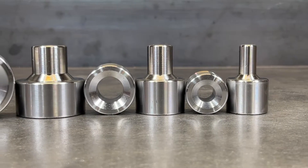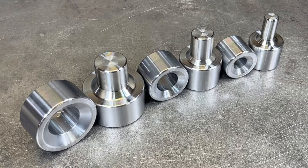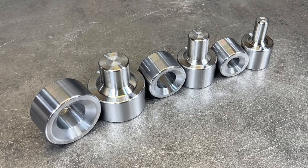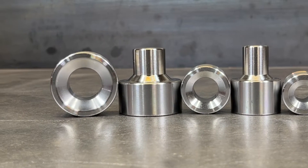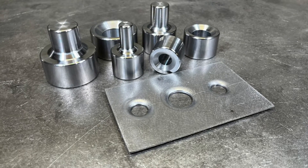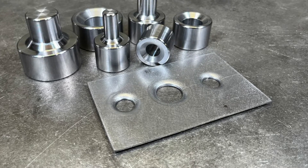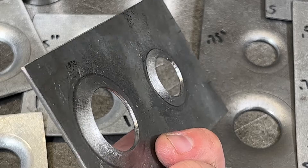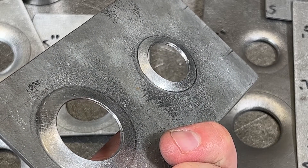Good dimple die sets aren't very cheap, but does that mean that cheap dimple die sets aren't very good? In this video I'm going to test out a set of dimple dies that cost me less than $50. A dimple die is commonly used in metal fabrication. To reduce the weight in a panel you can cut out or drill a hole, but in doing so you sacrifice rigidity. To get back and even increase the rigidity is where dimple dies come in. The flared edge around the hole can allow you to use a thinner gauge metal and stiffen up a floppy part.